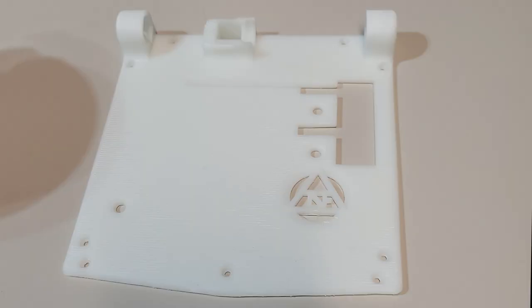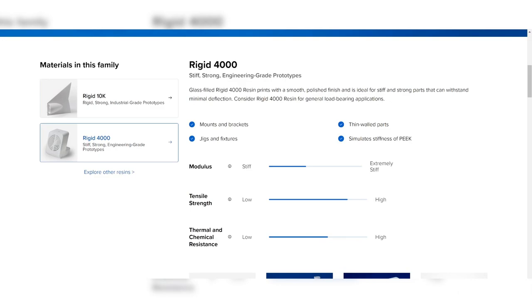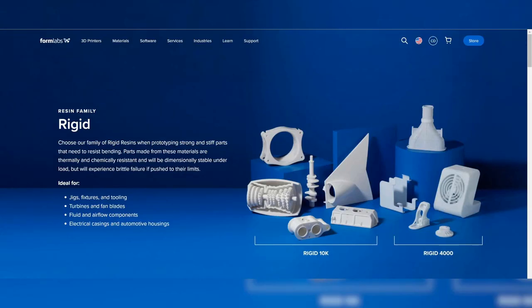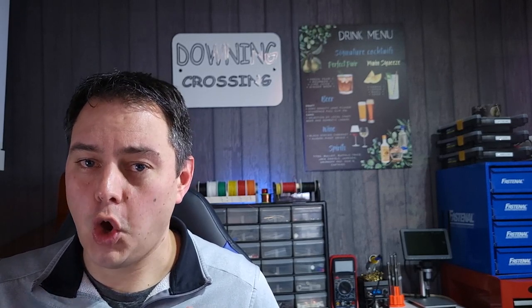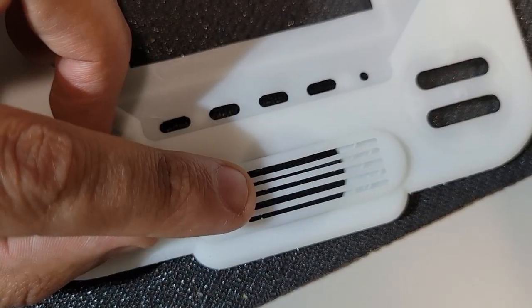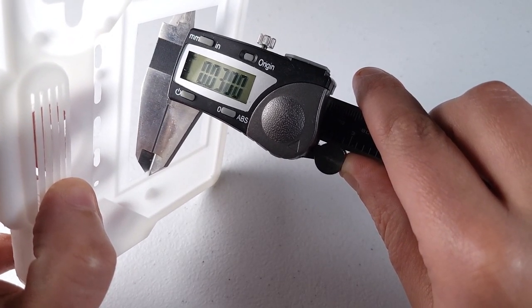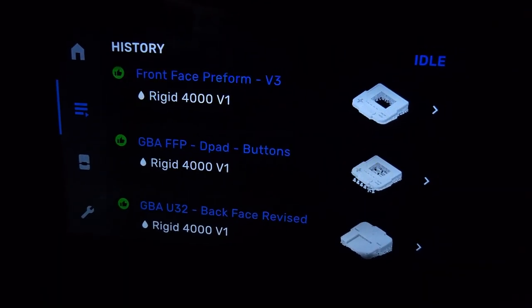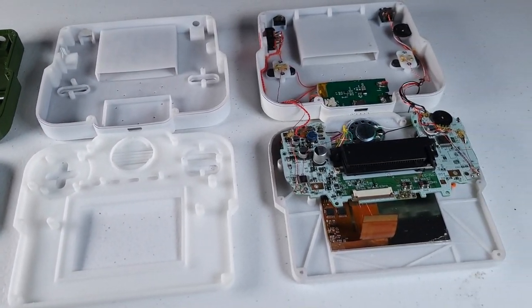This changed after recently printing a larger enclosure for a modding buddy named Shock Slayer. To try and combat the warping issue, we used a new-to-me material called Rigid 4000, a glass-filled resin that touted its structural abilities for holding thin walls in check. Initially I was very impressed, so I put it to the test by printing some insanely thin walls and flat planes, hoping I had found a solution. No. I had done a fit, form, and function test on the FDM printer first, but there's no real way to test how the final material will work unless you print with it. So despite the helpful test prints, I ended up having to reprint the front half three times. That got old real quick. But these reprints gave me a chance to learn workarounds — adjusting plane thicknesses and adding support ribs — and this was honestly the first time I had to use real engineering in a case design to get around known issues with the process.